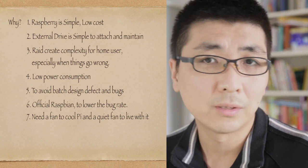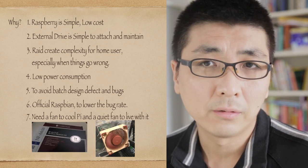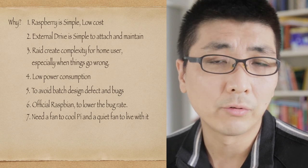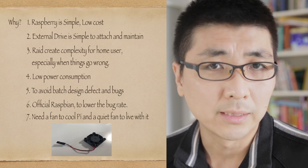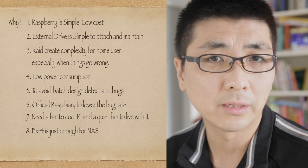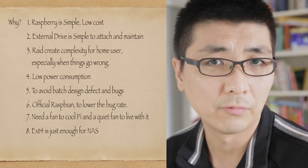Number seven: choose a good fan. If you want to put your server in the living room or anywhere near your normal life, spending more on a quiet fan will save your sanity. I dumped my one-dollar fan and bought a Noctua fan for $15 — it's amazing and worth the money. The Raspberry Pi 4B chip will average 65°C without fan cooling; any fan lowers that to below 40°C. Number eight: use the plain OS with the default ext4 filesystem. Forget ZFS, Btrfs, etc. — they look fantastic, but just stick to the old ext4, which is robust enough and friendly to performance.